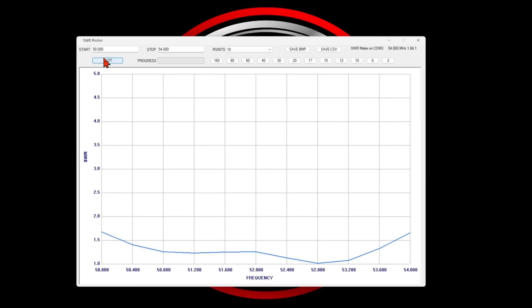On six meters we have probably the best SWR reading. Listening on 40 meters early in the evening, there wasn't a lot of traffic and propagation wasn't great here in Tampa Bay. Two quick QSOs on 20 meters let you hear the quality of the sound I'm picking up. It is a noisy antenna because of the non-standard configuration, but if this is all you can do, it's fantastic. Finally, we'll look at those whisper maps, which are quite impressive for the way I installed this antenna. I'm just learning WSPR now, running at 200 milliwatts — 0.2 watts. I'd be careful about running a lot of power on digital since the wire is actually touching my roof shingles, but for some digital modes you could do some pretty good reception and contacts.